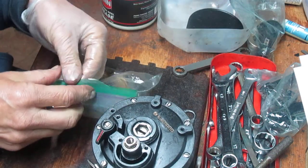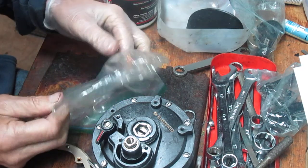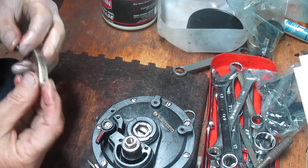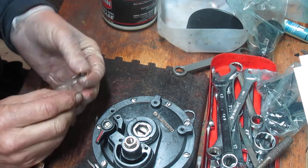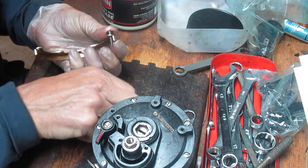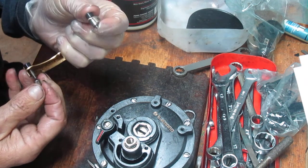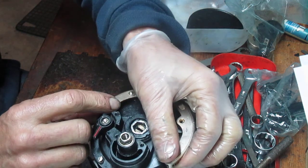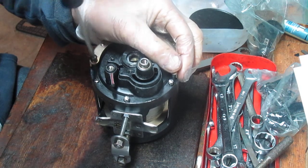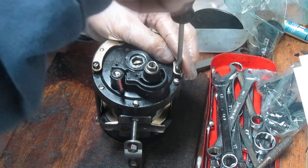So we're going back up top now and putting that collar on — it controls the stops for the free spool and the full engagement. I start by taking the two long screws, which are the ones that are the stops. There's a little metal collar on top of the screw and a metal collar below the screw — those are on the two outside posts. Get those on first, then shorter screws go in the middle. Line them up and get them started. And I'm noticing I kept two screws I didn't finish — let me go finish those side plates.